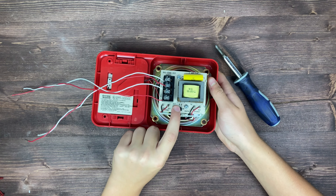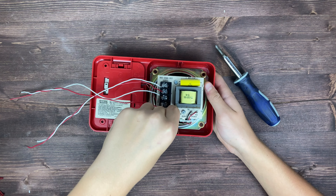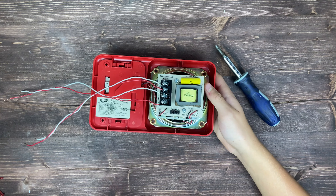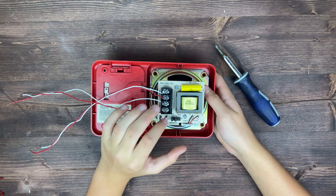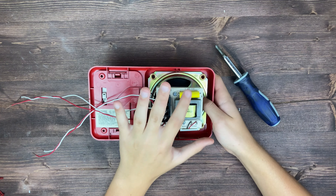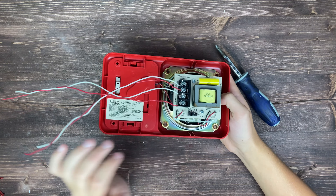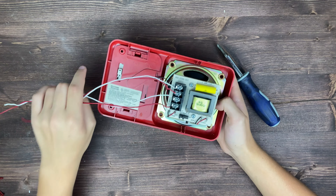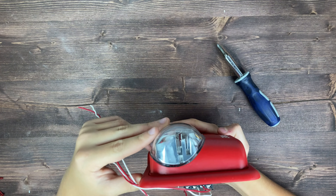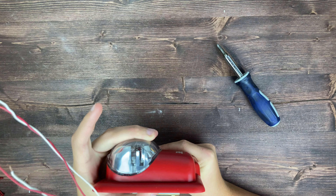There are these little clips that go on the wire — basically this touches the two wires together. It clips on and you can change the wattage that way. All you've got to do is go to the one next to the wattage that you want and clip it in there — it just fits right in and you push it down. You do the same thing for volts. If I want it on 25 volts, I just push it down and make sure it clicks. Once they're in there, that will touch the two contacts together so the speaker strobe operates at whatever voltage and wattage you set.